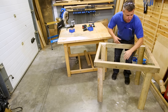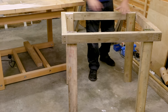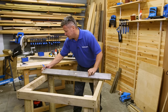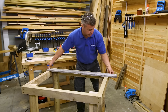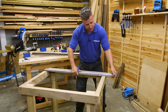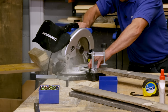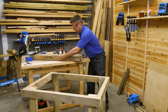That's the four legs and the top frame constructed. The next stage is to fix the slats across the top. The standard size of the slats are usually about a meter or 1200 millimeters in length, so we're going to place one on one end, offer it up flush, make a pencil mark, chop it down, and repeat that with nine separate pieces to cover the entire top. So that's nine pieces all cut to size.